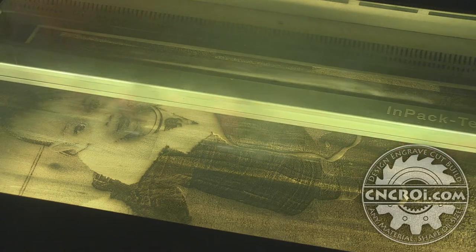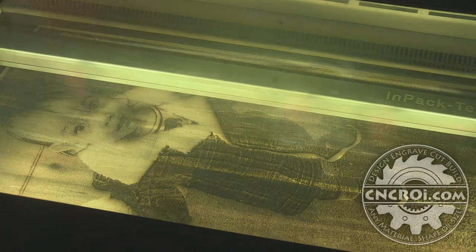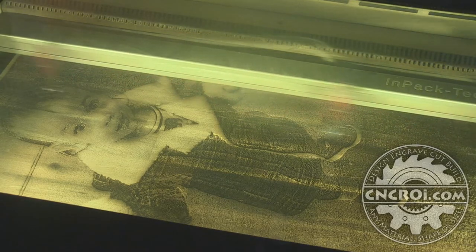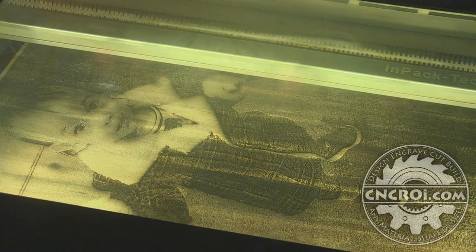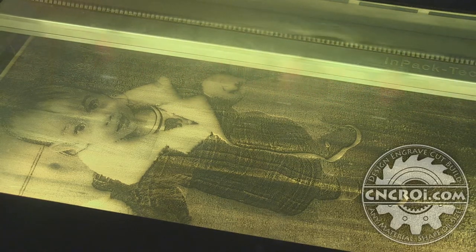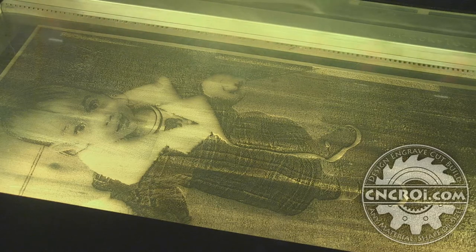On the first two photographs that wasn't an issue because the white areas don't actually laser engrave anything — as you can see around his jacket — so the sander can sit on that and sand away and clean off the surface without touching the charcoal that's underneath. The laser is pushing up a lot of smoke and resin and glues and all that kind of stuff, and it's settling back on the surface of the material, so that's why we do the sanding to remove all of that.